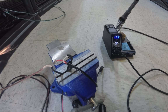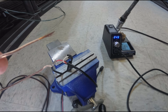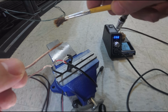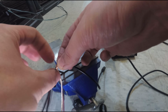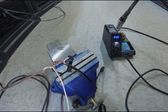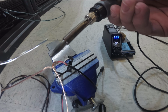All right, so I have my soldering iron heating up to about 330 degrees, and I'm going to put some flux onto the wire here. You can find everything that I'm using in the description. And now I'm going to wrap it around the rest of the wire there. And I have some lead-free solder here, and I'm going to put some onto the iron.